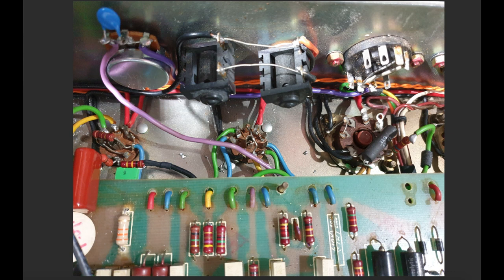All right, so this purple wire here was originally wired directly to the impedance selector. You've seen me do this before if you followed some of my other mods. Just remove that negative feedback line directly from the impedance selector, and then put this variable depth in series in between the normal line and where the impedance selector actually is, because this impedance selector, of course, is being fed by the output transformer, and that's where you get your negative feedback line from.